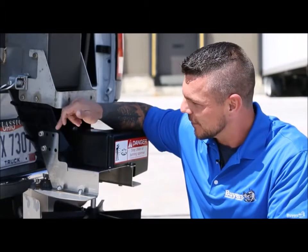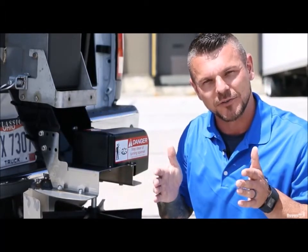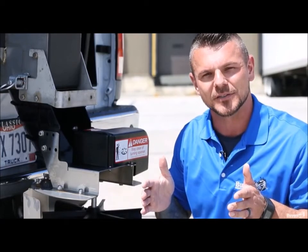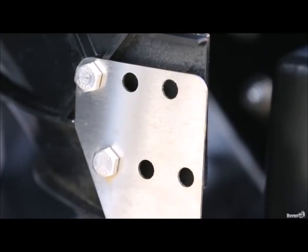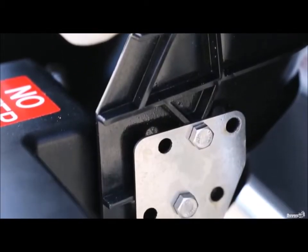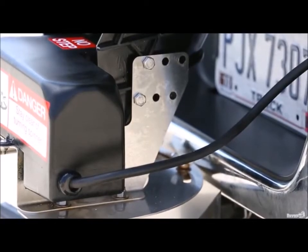The chute on your SHPE has three sets of holes on either side. These holes allow you to adjust your chute closer or further from your truck, changing where material falls on your spinner. The set of holes closest to the cab are perfect for lighter materials like calcium chloride. The middle holes should be used for bulk salt or things around the same weight. The holes farthest from the cab are for heavier materials like salt sand mixes.